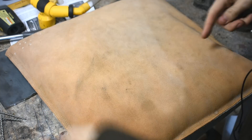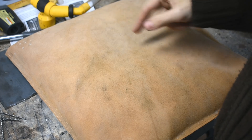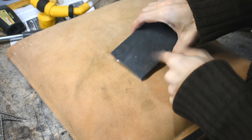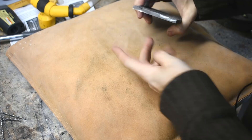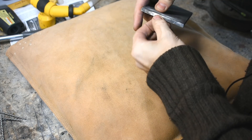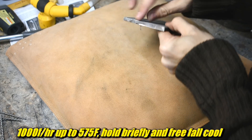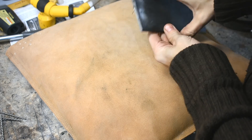Before we get to the fire, I want to recap quick. When I last left you, I was throwing a piece of steel into the kiln, seeing if I could heat blue it. This is mill scale — more like this, metal colored. My plan was to see if I could heat blue something, get the blue color. So I set it for a ramp rate I forget, and to hold for about 20 minutes — it's quarter inch, just mild steel. I ground the mill scale off.